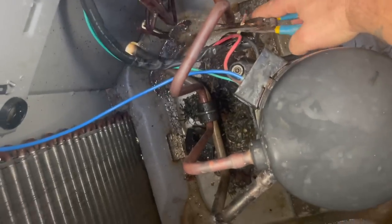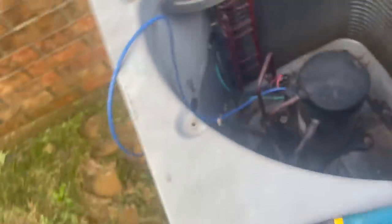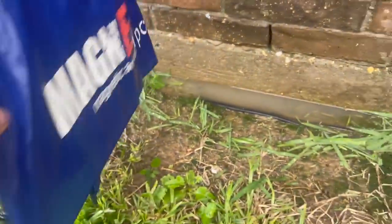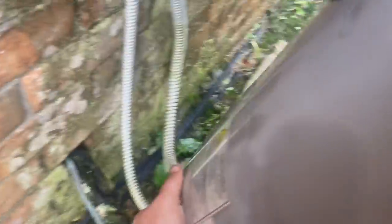The rain has pretty much stopped - I can probably get rid of the umbrella. I'm just going to chop that off because there will not be any voltage passing through that wire anymore. Setting the umbrella off to the side. Let's go ahead and close this thing - lifesaver right there baby, if you don't have one, get you one. Eight bolts in that condenser fan motor lid. Contactor still pulled in - I'm going to feed this wire through here and hook it up to the start, or the hermetic, on the capacitor.